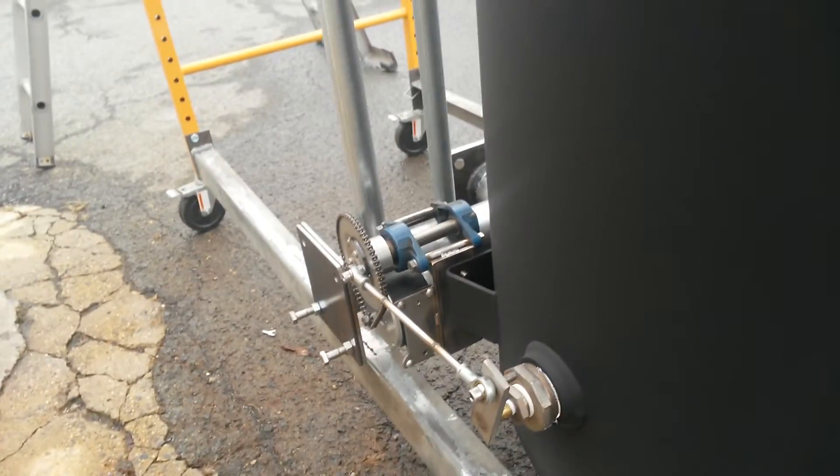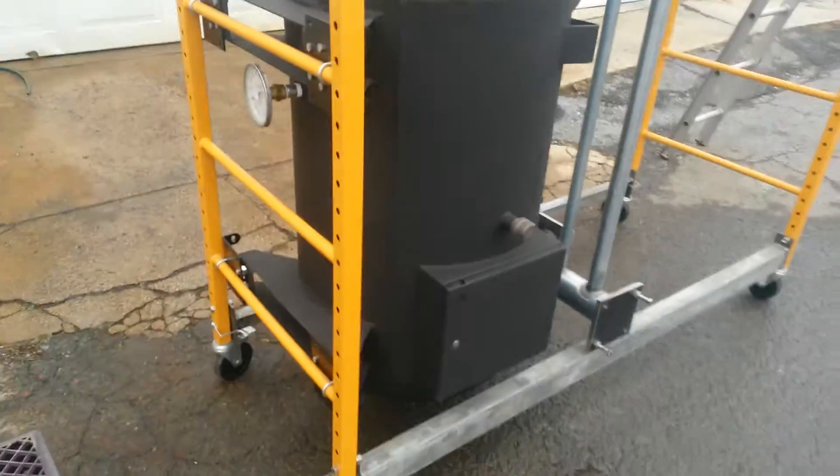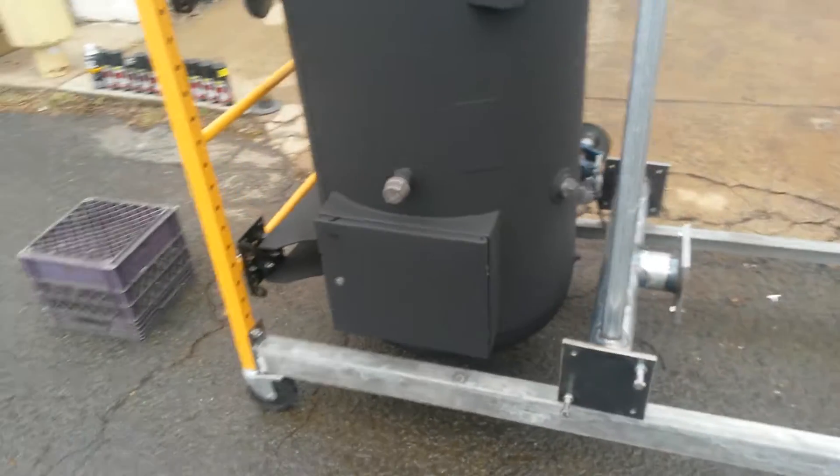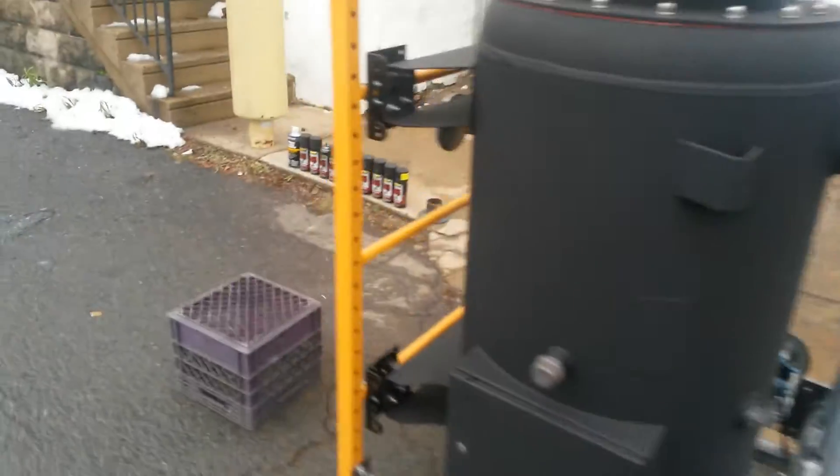That was another thing I wanted to show you — the inside. I'm going to go back inside here; I don't know if you were able to see the shaker assembly in the back, but I'm going to try to show it to you. I'm pretty happy with the way the rope gaskets turned out. There was enough material in that package that I got from Tractor Supply to do not only the door but around the rim between the hopper and the rim, so I got all that done.